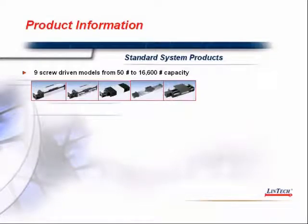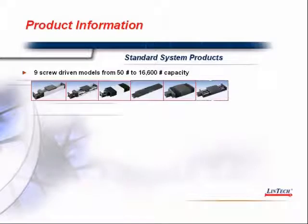The 90 series is the only system which utilizes round rail bearings and shafting. It has the most diverse volume of ball and Acme screws available with even a 1-inch diameter to allow for speeds up to 50 inches per second. It can also be equipped with solid bearings and stainless steel shafting for corrosive environments. This series has a dynamic capacity to 3,300 pounds.